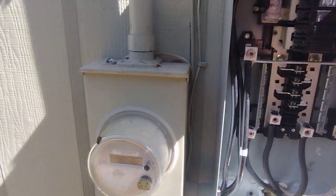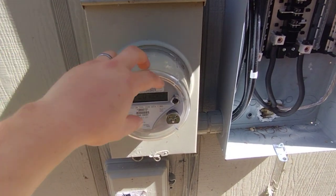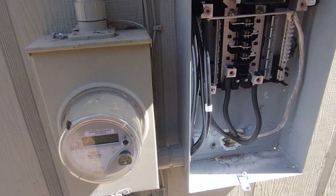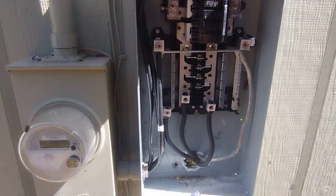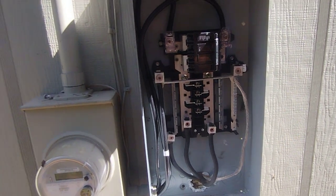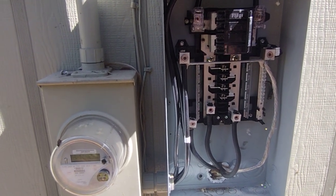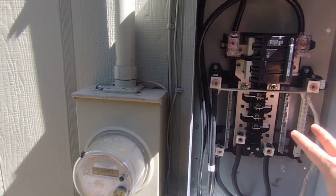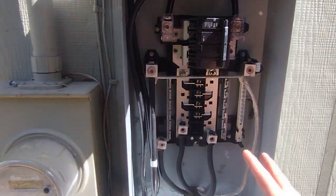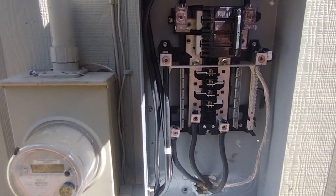Luckily he supplied the cables. Real quick — what you do here is pop open this panel for the meter and just pull the meter right out. It just pops right out and that'll cut off all the power to your home so you can safely do this job. When you pop this thing open, there's supposed to be absolutely no discoloration whatsoever — that other one was all burnt up inside. So if you see anything like that, that's definitely your problem. Good luck!